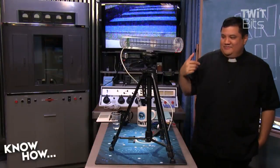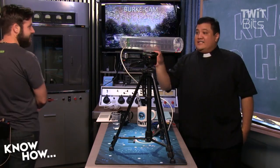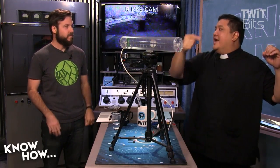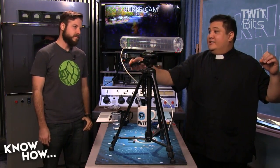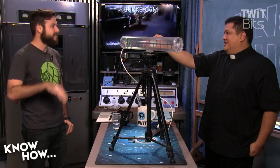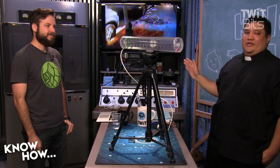Come back in here. So this is how it works. Ideally, since that's using a circular polarized antenna, I would want a circular polarized Yagi. This is not one, so I'm not getting nearly the gain I should get. What if he had a directional antenna on his quad? The problem is he'd have to keep pointing it at me, and that system is way too complicated and heavy to put on a quadcopter. That's what directional antennas will give you, and if we figure out how to make one of these inexpensively, we will definitely show you.